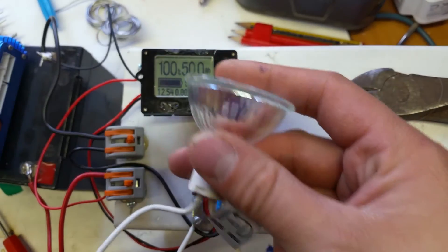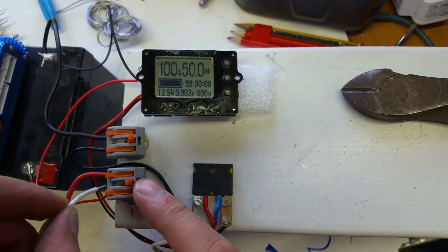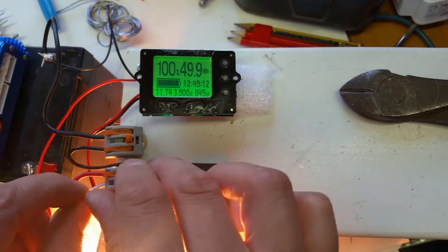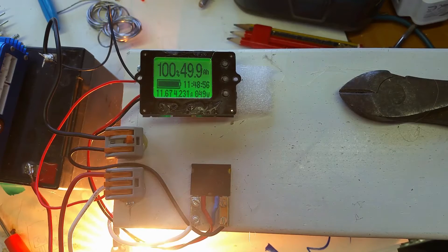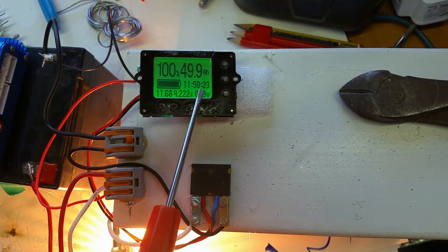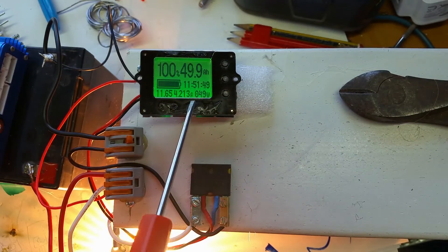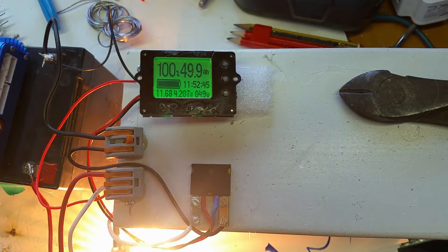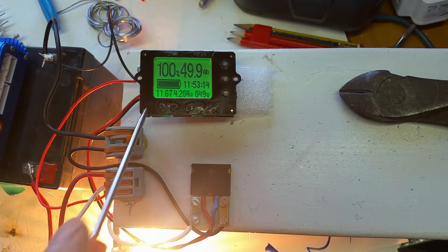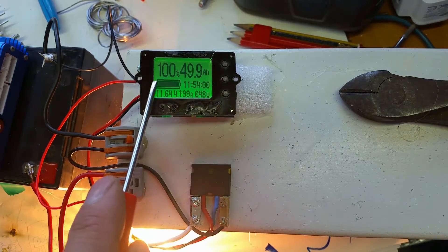Let's put it back up to full. We have a white MR16 12-volt lamp connected on the negative side of the shunt. I'll put it into the positive side and see what happens. Now it's getting warm — you can see it's putting 4.2 amps, 49 watts. With a 50 amp hour battery our pack will last 11 hours 50 minutes. It gives us percentage, power, time remaining, wattage, amps, and battery voltage. All of this information is useful — more information is better than none. This bar declines as the discharge happens.